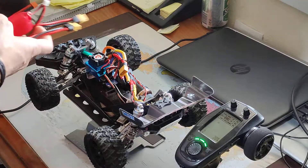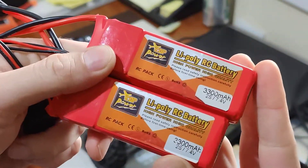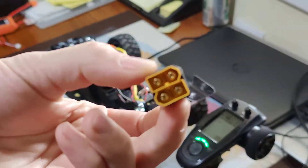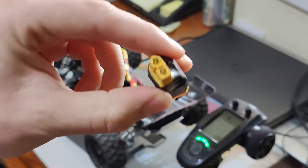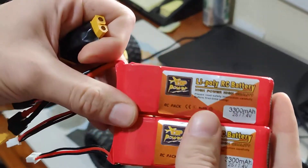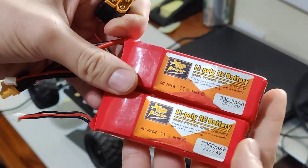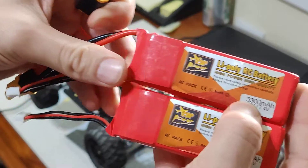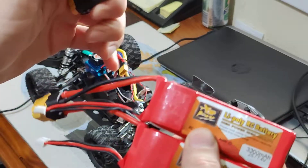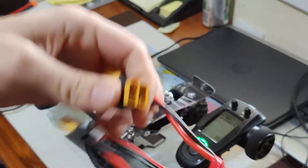To test 4S, I don't have a 4S battery, so I'm using two equivalent 2S batteries. They are fully charged and I created this series connector in XT60 to connect them and convert to a 4S battery. Remember that if you connect batteries in series, you double the number of cells but keep the same capacity — 3300 milliamps in this case. If you connect them in parallel, you double the capacity but keep the 2S. I want 4S, so let's go for it.